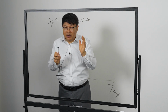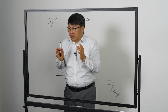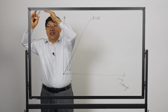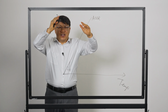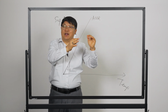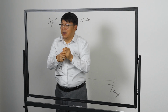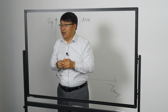Sommer knee point. And what is the Sommer knee point? The Sommer knee point is a temperature at which the aluminum reaches zero tension. So they were under high tensions, and then with temperature going up, the aluminum expands faster. So gradually and eventually it's going to reach a point where the tension in the aluminum strand becomes zero. And then if the temperature further goes up, the aluminum strand may go into compression. And when the aluminum strand goes into compression, it's the core material that takes over, and the sag will be driven by the thermal expansion in the core.